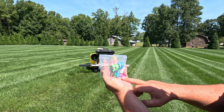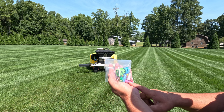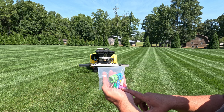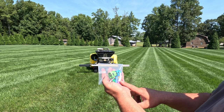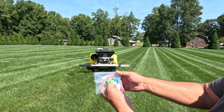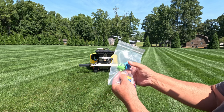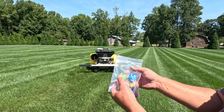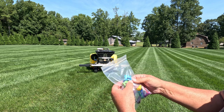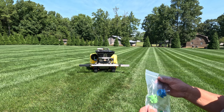It comes factory with the lavender nozzle, and you can spray 15 gallons per acre, which is considered low volume. For some things low volume is fine and dandy. If you're doing just your common weed control, that's fine. But certain fungicides, I'm going to run these big boys here at 2 gallons per thousand. With my plant growth regulator, I am going to run the blue nozzle at 1 gallon per thousand. So there's tons of options with this new machine.